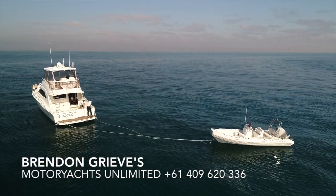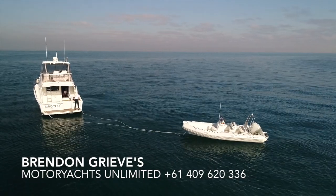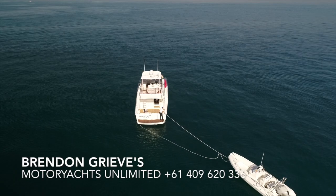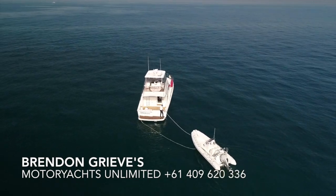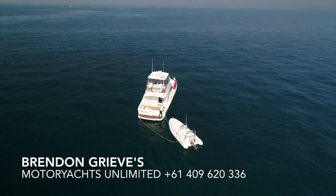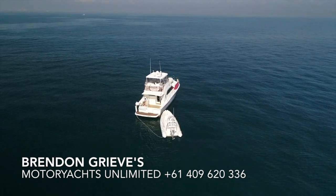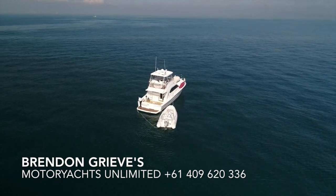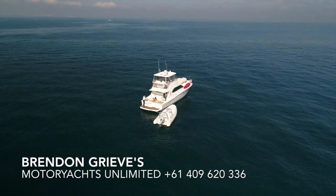Once you get to your destination, it's not advisable cruising in with your tender 35 metres behind you — you'll end up wrapping it around a mooring buoy or another boat. Haul it in as soon as you're in protected waters to get it closer to the mothership. You can have it towed close behind, though you'll need someone keeping an eye on it so it doesn't run into the back of you. Alternatively, raft it alongside. In my next video I'll be talking about how to raft alongside correctly, and how to tie your tender up so it's not bashing the mothership all night. Thanks very much for watching — special thanks to Tim Fladwell for the use of his Riviera and Brig, and to Mark from Sirocco Marine Perth for his advice on tenders.